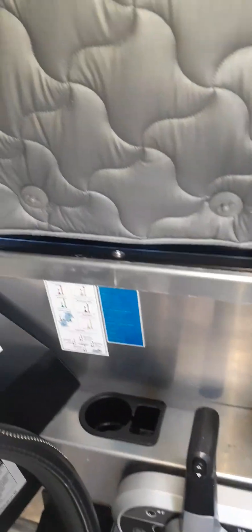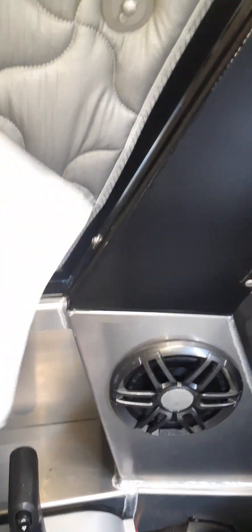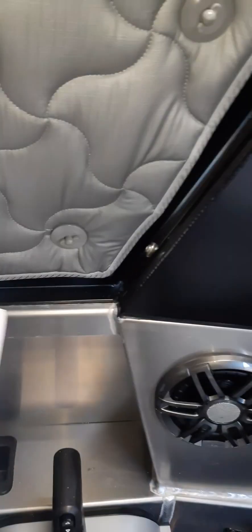The first one is window leaks. On the starboard side window I've had quite a few leaks — you can see the corrosion starting to happen. There was missing sealant up the top on the outside, which I tracked down by blasting water with a hose. It was just some sealant missing so I squirted some Sikaflex in there. Also around the bottom the silicone was separating from the window and water was ingressing really slowly and dripping, so it was a hard one to track down. I cut out the old Sikaflex and put some new stuff in.